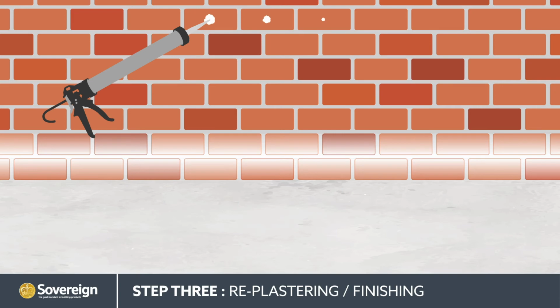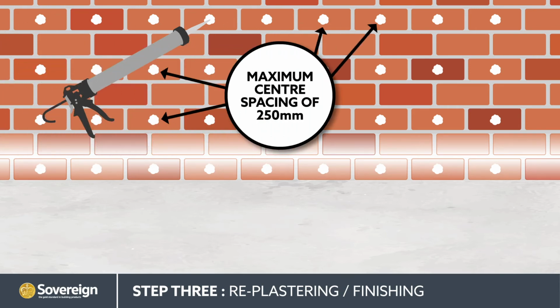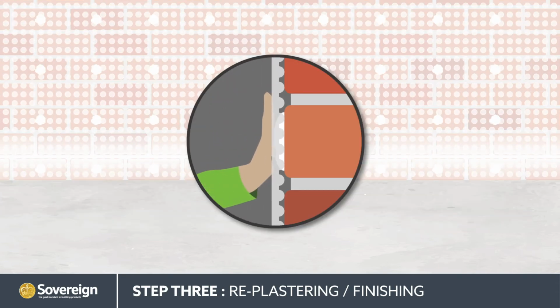Method 2. Sovereign SovStik Adhesive. For a quick and easy solution to applying Sovereign lath membrane, dabs of the specially formulated SovStik adhesive are gunned out over the entire area at a maximum center spacing of 250mm. The membrane is then pressed against the adhesive and wall substrate.